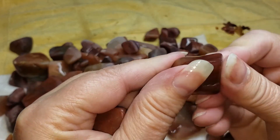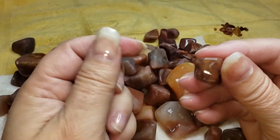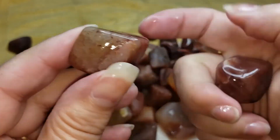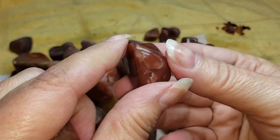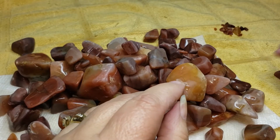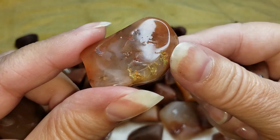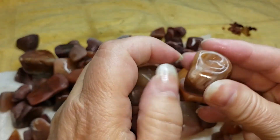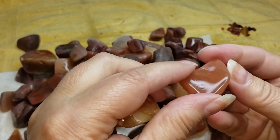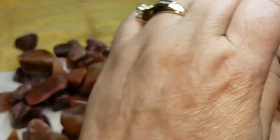That's almost like I want to send it to 120, but I think it would be premature. Let's give it a week with ceramic media, because there's still a little bit of shaping that can be done. We dumped all the slurry and everything because we were looking for the chips. We're going to recharge the barrel.